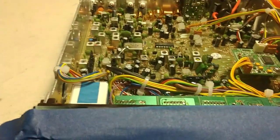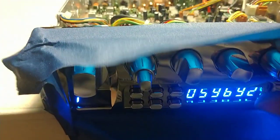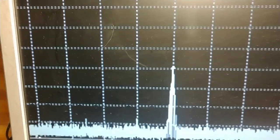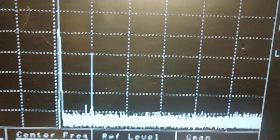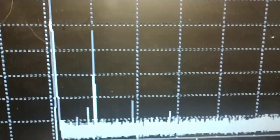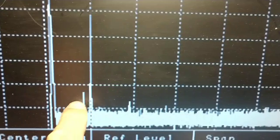We're back with the RCI 69 VHP. We've got her tuned up here. I'm going to turn this variable all the way down — and it's clear right there, that's about 12 watts PEP. We'll take you out to 300 megahertz — you can see it, got a little bit showing right there but nothing across the board, it's clear. Now we'll turn the variable all the way up — and that's back to a 23-watt carrier where I've set it. We've got the second and the third harmonic showing.